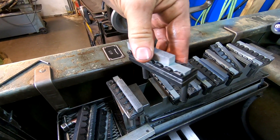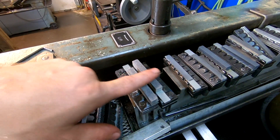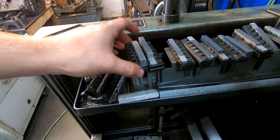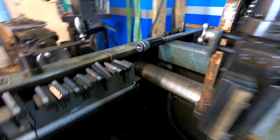I use this pad here — I set the same shim stack in the other stone and just make sure they end up the same height. These stones don't always wear out equally, so sometimes you end up with more shims on one than the other. Then just slide them into the mandrel like that.